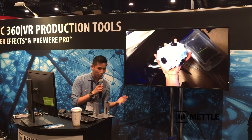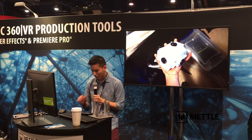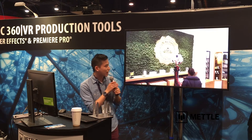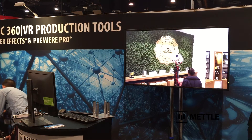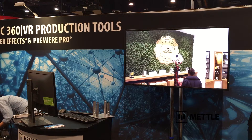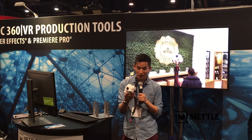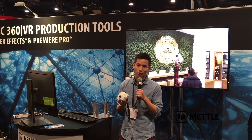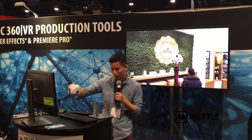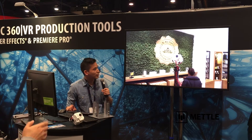One of the things that disappointed me with this rig was that I had to go in and press every single button to turn them on and start recording. So what I did was wire every single shutter together — I just took the cameras apart, wired all the power buttons together, and wired all the shutters together. My original intention was to get Genlock and Sync, but that's just not possible. With this many cameras, I think if you use opto isolators it would work, but I haven't explored that fully yet.